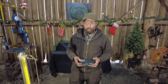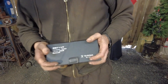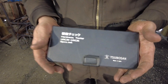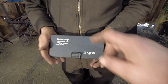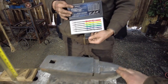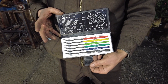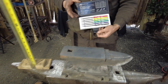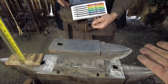Okay folks, here we are. We're going to use this hardness testing kit from Subosan - you guys saw this in the previous video. You can check the Amazon affiliate link down in the description below. This tests all the way from 40 HRC up to 65 HRC. We are going to go ahead and test to see whether our case hardening actually did anything or not. We did wire wheel the top of this anvil - it hasn't gotten shiny. I haven't ground it because I'm not really sure how far the case hardening compound goes down into the actual surface, so we want to do as true testing as we can.